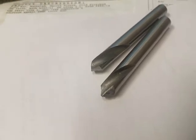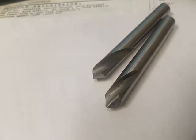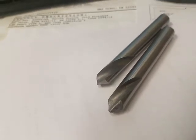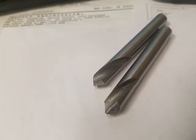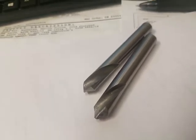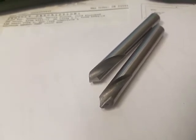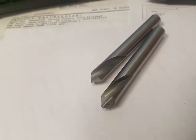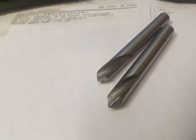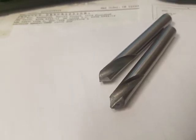That's the best explanation I can give. I'm just trying to help you guys out and maybe save some money. It is important that you do get the appropriate size spot drill. On my link it shows some other options and you can get some stuff from McMaster. You can also buy some reversible drills, but the reversible drills are a little bit tricky since the angle is a little weird — 118 degrees — and they do tend to want to just rip into things, which might damage your existing threads. I would suggest trying to get this modification to work first.